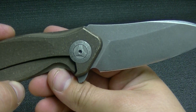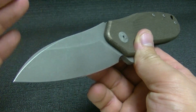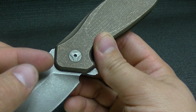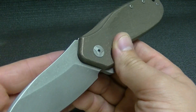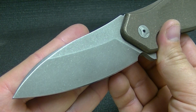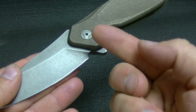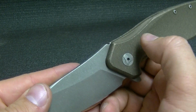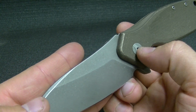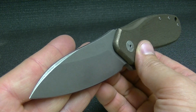Maybe we'll do a takedown video on that and show you, just because I thought it was pretty unique. I've worked on a lot of knives by now, and I just hadn't seen that. And it's a great idea, because if they're hardened ball bearings in there, it makes sense to ride on hardened washers. But those washers have to be on the inside and the outside. Well, I guess they don't have to be, because like the Zero Tolerance 560, the 801, they do not use that system. But anyways, I thought it was kind of unique. Spyderco does a washer that goes against the titanium, just so it doesn't roll inside. The titanium is pretty soft, so it rolls on a nice hardened surface. But anyways, I thought it was unique because they're nice beefy washers that sandwich that bearing, and then all the milling inside. I don't know, pretty unique.